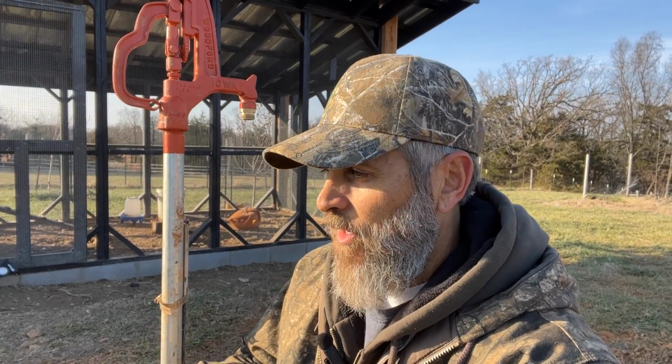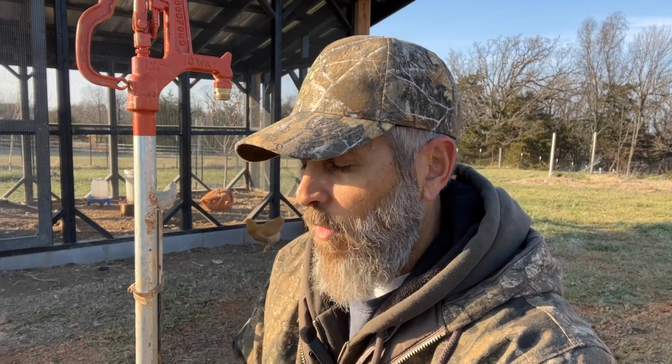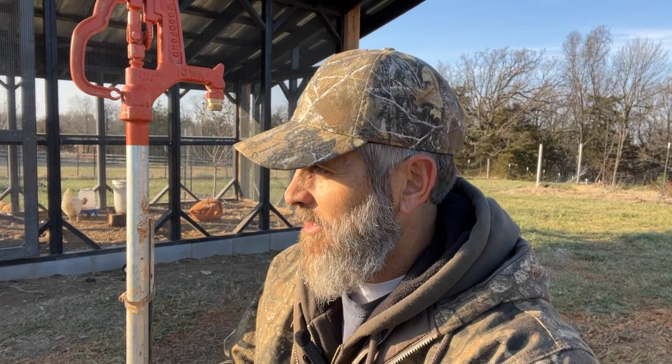One thing I'll note is everybody's situation is just a little bit different. We're in the Ozark Mountains here, and we have very rocky soil, and so I had to put a bedding of grit down to bed that poly pipe in, just because it's so rocky. Now you may live in a sandy environment, or some soft soils, and you may not need to do that. But if you've got rocky soil, it's something that should be done. Also, we are in the south, so our frost line is only 14 to 18 inches around here. So I didn't have to go that deep. In your area, you may have to go a lot deeper, so check what your frost line is.